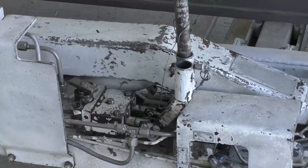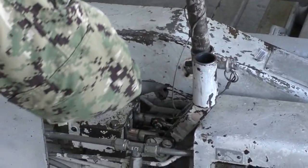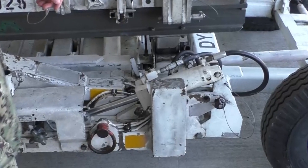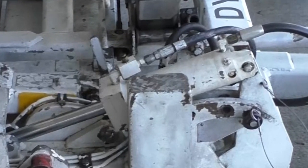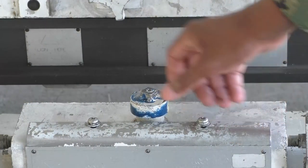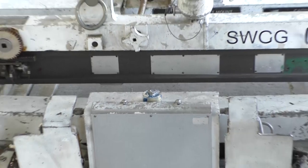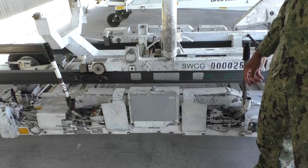Inspect the hydraulic system. This unit's hydraulic system consists of four pumps — two sets, forward and aft. The inboard set is used for actuating the wheel assemblies, and the outboard set is used for operating table actuators. There are four actuators for the table assembly and one actuator at each wheel assembly. Pay close attention to the actuators and seals for evidence of leakage, which would be cause for rejection. Check all connecting lines for pinches, leaks, cracks, and fraying. For the hydraulic reservoir, check for proper fluid level. Make sure the table assembly and wheel assemblies are in the lowered positions prior to checking level. Failure to do so may result in an over-service condition if fluid is added. Verify that fluid is at least three inches from the bottom of the tank. Service with MIL-PRF-83282 hydraulic fluid if required.